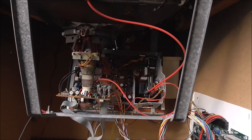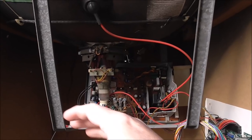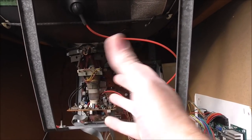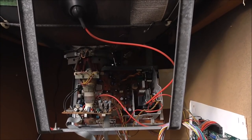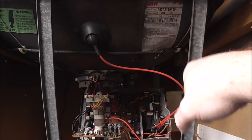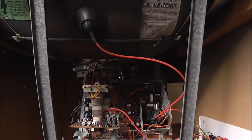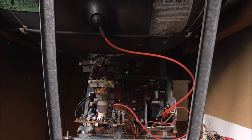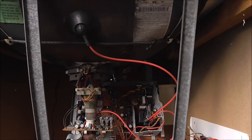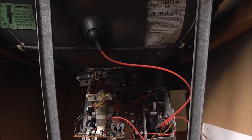Most of these have a bleeder circuit in it, or I don't know what you would call it, where it bleeds off the high voltage. Since this one's never coming fully up right now, it's not creating any high voltage. As it's starting, it's shutting back down. If it was to charge up the tube, once you turn it off, that charge would trickle out of the tube through the flyback to where after a few minutes there wouldn't be any charge at all. Some of them do it pretty much instantly, within a few seconds. But if there was a problem with the flyback or something, it may not be able to do that, so you can't count on that. But again, people make it like it's the end of the world. It's not that big of a deal.